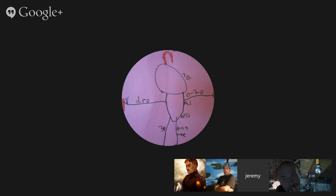It's the same thing as if I go over here and I've got a high voltage diode coming off of the collector here. If I hook, instead of hooking the meter up to this ground loop, I hook it up right to this diode, it's almost exactly the same microamp measurement.